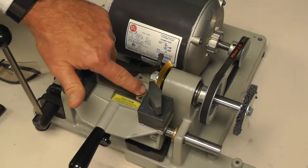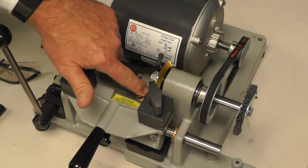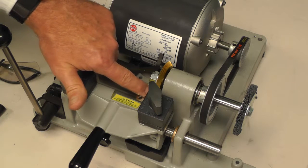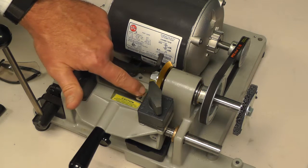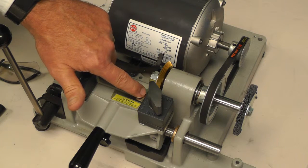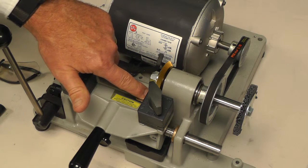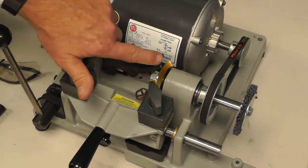The space that you want is a minimum of one sheet of paper clearance to two sheets of paper maximum. If you take a sheet of paper, fold it in half, and it fits, your spacing adjustment is fine and there's no need to change it. But if you notice a noticeable gap bigger than two sheets of paper, we need to adjust the gauge fork.